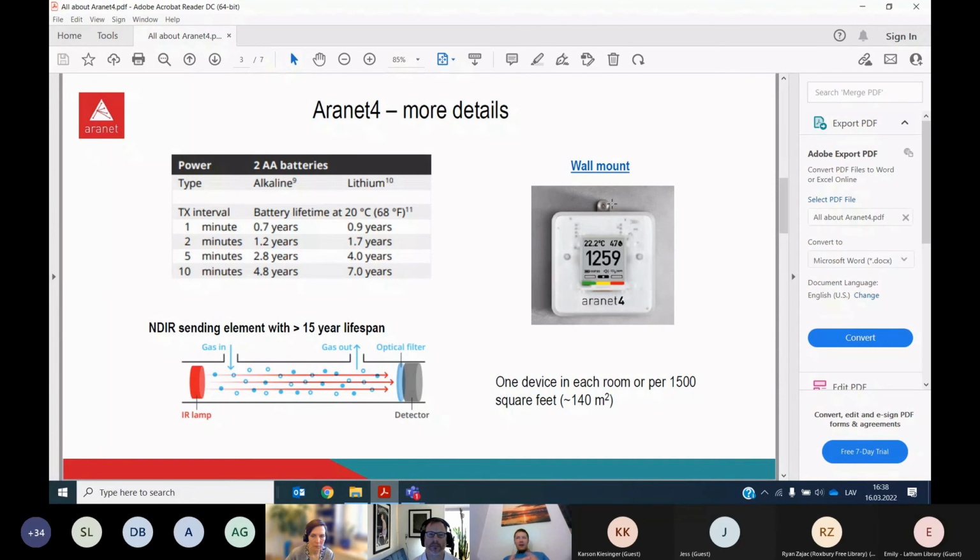It is also recommended that nobody is within a 2 meter radius, and at least 1 meter from the device, because if you breathe into the device, you can test yourself. But I would not recommend this. The readings can go as high as 10,000 if you breathe directly into the device. You can also damage the device, and it will not represent the real situation if you are too close. So these are the main things to consider, but this depends on each location, and then you can consider all these things and find the best place in your particular room.